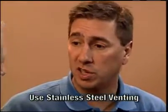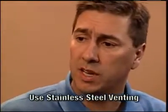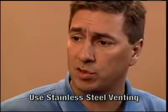Okay, let's go through those differences. Sure. The first is the exhaust vent material. A tankless water heater is a power vented appliance and requires a stainless steel sealed vent system. The reason being is that the cooler exhaust temperatures mean there may be condensation forming in the exhaust vent. That's why you want to use a stainless steel material.